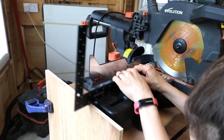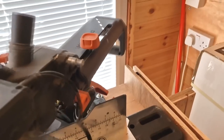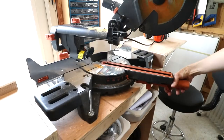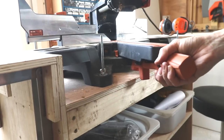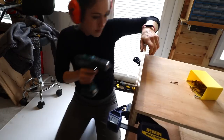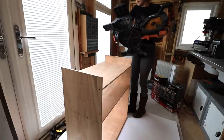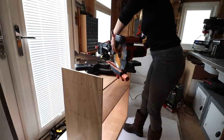I'm going to forewarn you here — make sure you fully check the angles of your mitre saw. I knew my sliding function wouldn't hit the sides, but I hadn't realised yet that there's a protruding lever on the Evolution saw which would hit against the front shelf. So you could either get the height right and rout some notches in the shelf, as I'll be doing, or set the shelf a bit lower and use shims or packers to lift the mitre saw up until level — that should allow for any protruding bits on your machine.